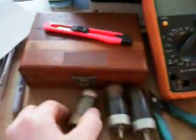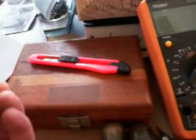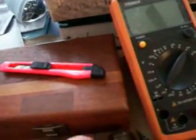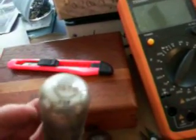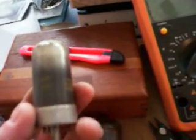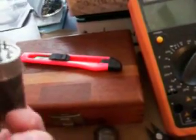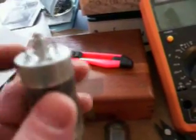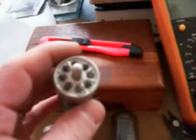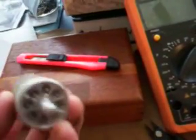Here are some of the tubes that I pulled out this morning. This is a Philco Loctal. This was a Raytheon. That's the rectifier tube, 35Y4. And the date codes on there are 280 and 413. And this tube is missing 3 pins, and I think that's the way it is from the factory. Here, here, and here, because there's really nowhere that they had a wire sticking through there. That's just the way it is. And here's the 50A5 output tube. That's a General Electric tube.